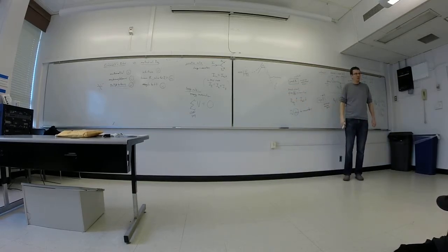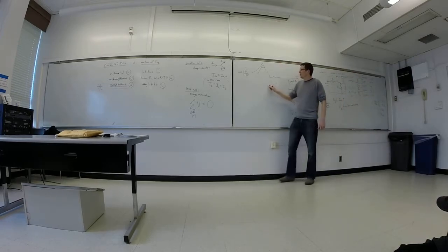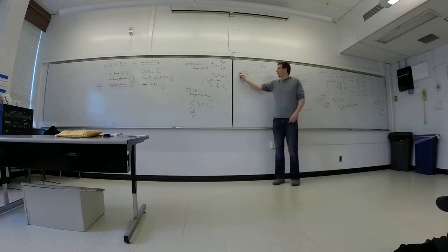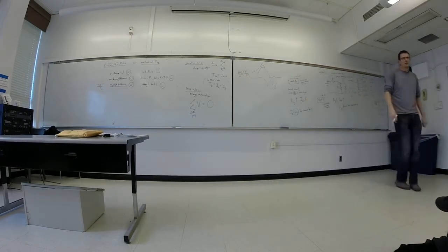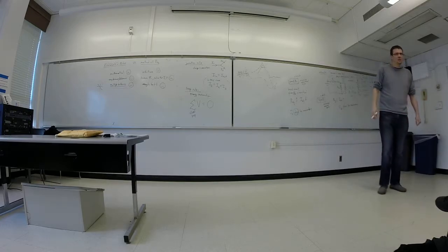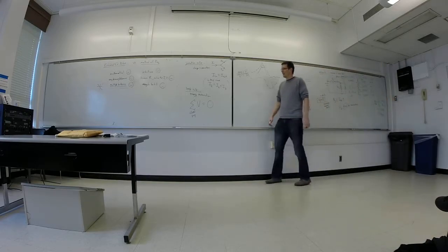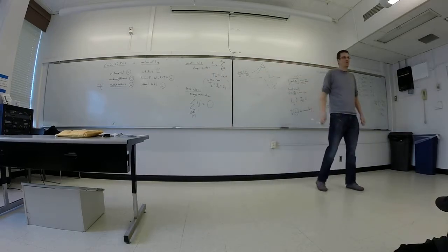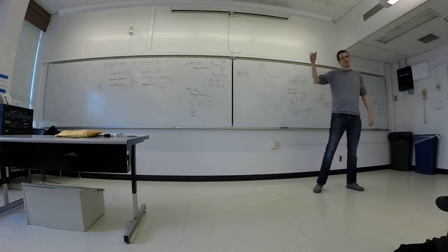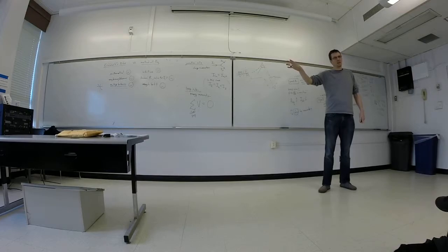Chances are your couch is not below sea level, okay? So you can have all these gains and drops, and then you come home, you're back at 100 feet again. So what's the difference between where you started and where you ended? It's 0. If your couch is at a different height at the end than at the beginning, there was some kind of major seismic event, okay? So that's all we're saying in a circuit: when you start off at some place and then you go somewhere else and you come back, it's still the same voltage as when you left. All the gains and drops that you had along your journey have to have canceled back out when you come to 0, okay?